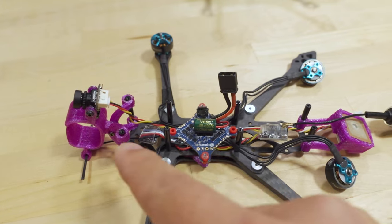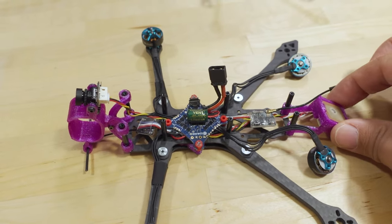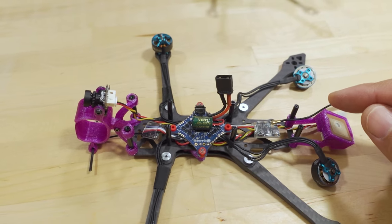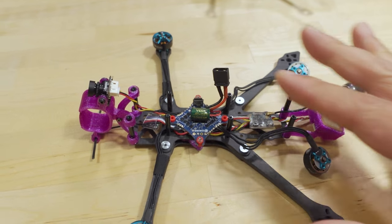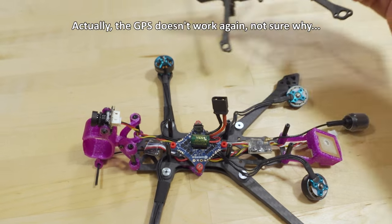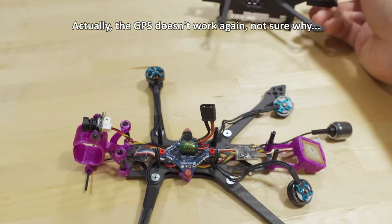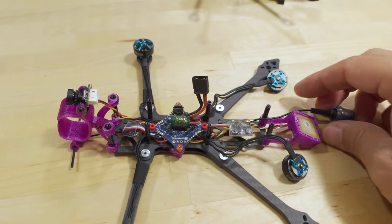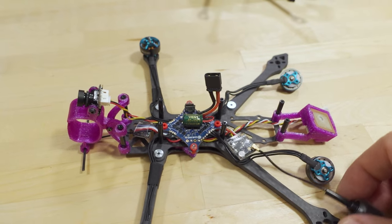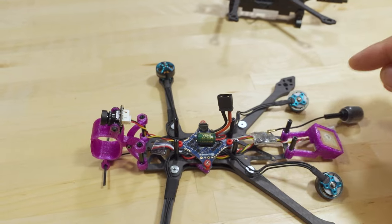I created all these little 3D printed parts. I'll link those in the description. A little mount for the GPS here, the M80 GPS, which I was able to get to work once I pulled all the parts out. I think possibly the VTX might have been interfering in the way it was stuffed in here. So we'll have to see. I have to try and keep the VTX away from the wire that goes to the GPS. That should let me get the locks and probably some sort of a mount here in the back off the top plate.